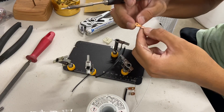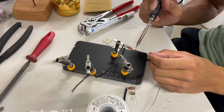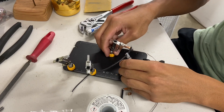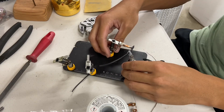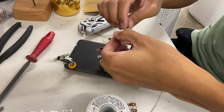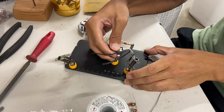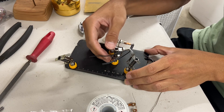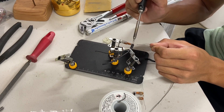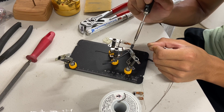This is the one without the extra tab and it has the extra long tang. I designed this section to be extra long so you can add multiple wires to the robot without having to do a Y-split later on. In this case I'm running a 4-in-1 ESC and this little guy is for a 5 volt BEC for the receiver, so these are the only two wires I need. On other robots you can stack up a bunch of power wires for all your ESCs and solder it that way.